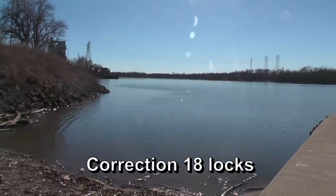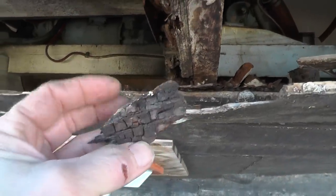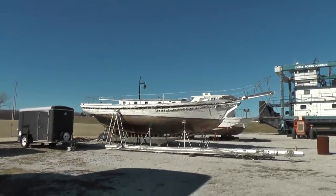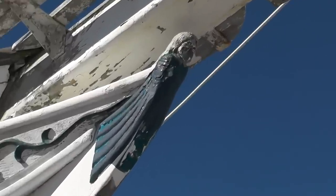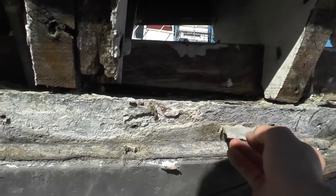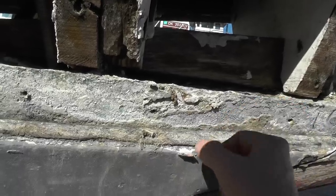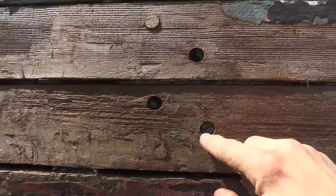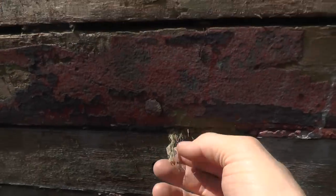Only 15 locks between here and the Mississippi River over 400 miles. And right here, this is why I don't want a wooden boat. There's his diesel engine sitting inside there — yeah, he's got some work to do. There's another one. Same problems. They've got brass bolts holding the boards on and they plug the holes with wooden plugs. You can see the fiber chinking that they're using. Man, I don't have that to do.